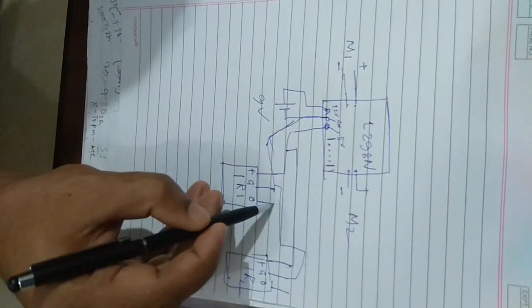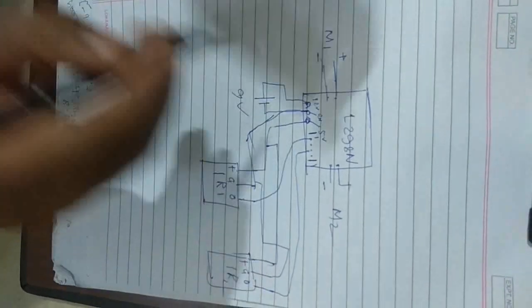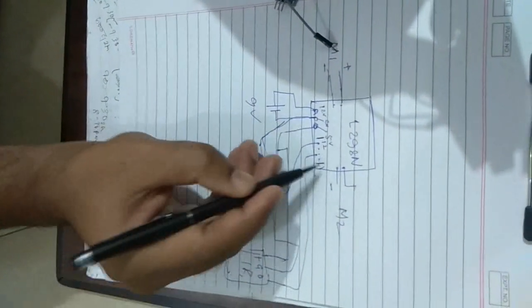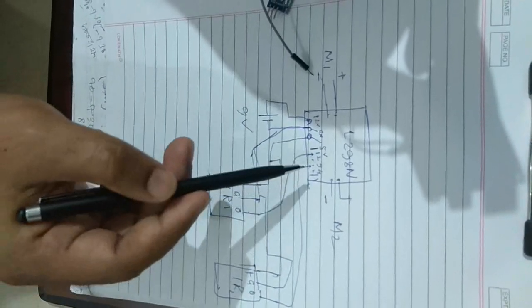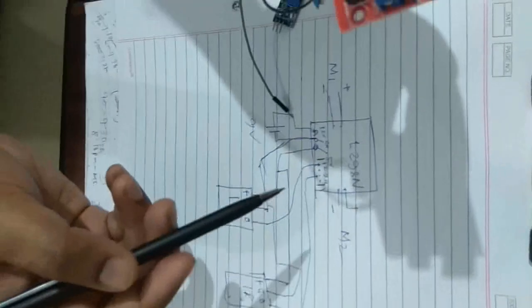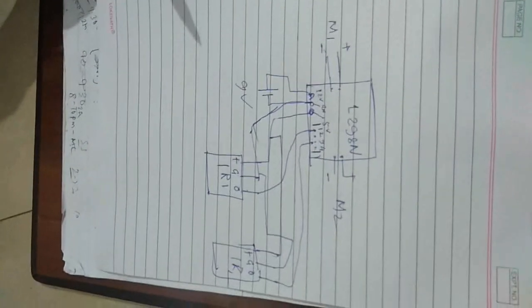We will send the IR sensor output to the input pins. If you connect it to input pin 1 then the motor will rotate in one direction, and if you connect that output to input pin 2 then it will rotate in the opposite direction. This way you can control the rotation of the motor without having to change the battery terminal connections every time. That's the circuit diagram — I will post it on my website and send a link. Now let's go to the hardware and start building.